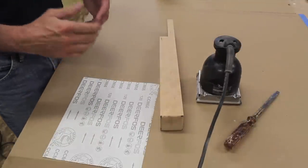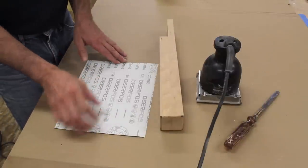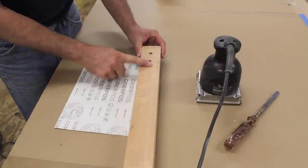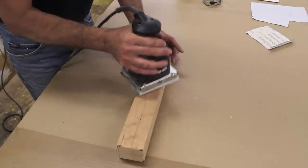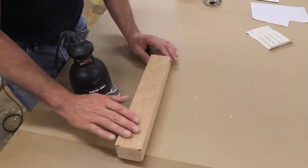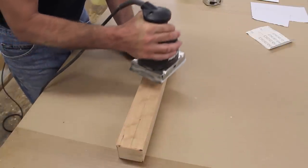The legs are already in pretty good shape from being run through the planer, so I don't need to sand with 60 or 80 grit. I'm going to sand with 120 grit silicone carbide paper using my orbital sander, and the paper is C-weight. Sandpaper is generally A, B, and C — A being the lightest weight and C being the heaviest. If you're using an orbital sander, it's good to use C, the heavier paper. As for sanding the legs, I'm only going to sand three sides: the sides, the inside, and the front of the leg. The side with the plugs I'll sand last after the legs are attached to the cabinet. When sanding, I want to make sure I'm flat on the surface — I don't want to roll the sander over and soften these edges up. I will lightly soften the edges when the entire cabinet is assembled, using 120 A-weight paper to just lightly take that sharpness away. It's really important to keep the palm sander nice and level right on your surface.